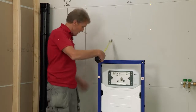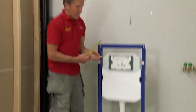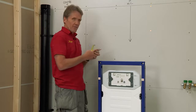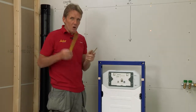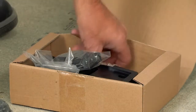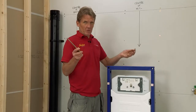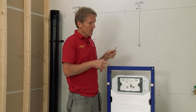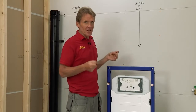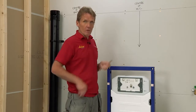That 225mm gives us ample room for the soil pipe behind. The Abacus package system even gives you two sizes of bolts so you can cope with whatever the installation requires. This is one of the rare occasions when you don't worry about having a few bits left over — they're giving you all the variations. Some people say they're paying for bits they don't use, but when you add up the cost of other frames plus all the extra bits you need, this is a competitively priced, cost-effective frame.